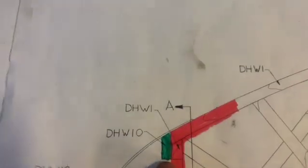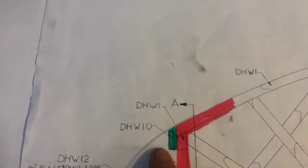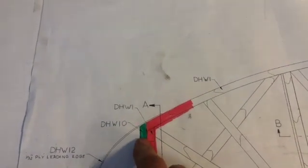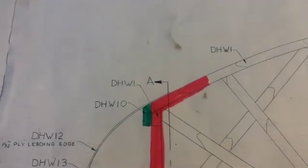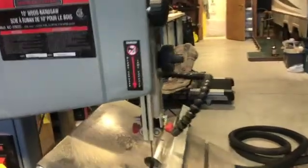From the factory it seems they would cut an angle in there. I machined down three-quarter by quarter inch — I've got fir, it calls for pine — so I machined that down. Before I got it down all the way to quarter inch, I cut this groove in there. I put it at about 30 degrees and I just used the bandsaw, tilted at 30 degrees, and ran it through — and it seemed to work.